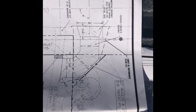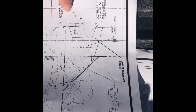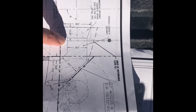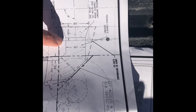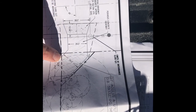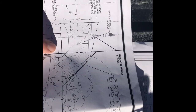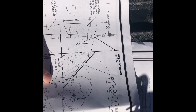From a drawing perspective, we're coming in off the main road here — Crabapple Road. We've got a 12-foot apron here with a flare. We ended up going with a radius because it's a commercial eight-inch thick. And then you have a 24-foot wide drive that comes around and ties into the existing driveway to go around this property, which is not owned by the same homeowner.